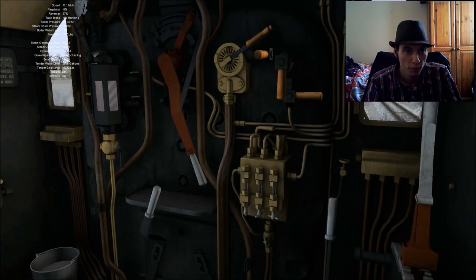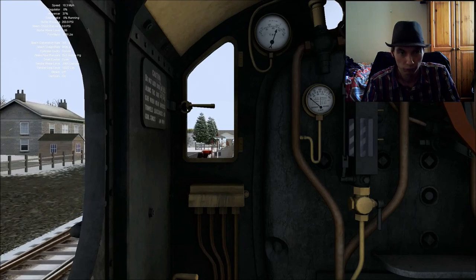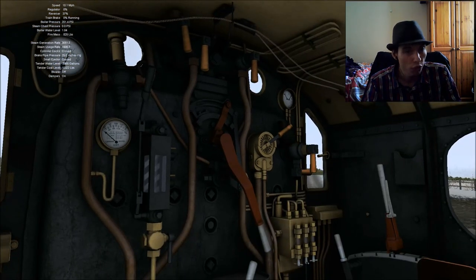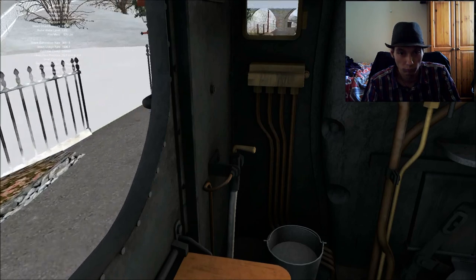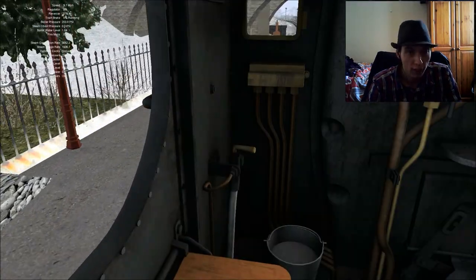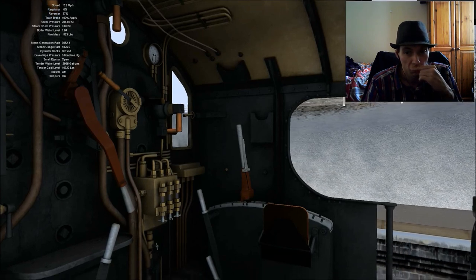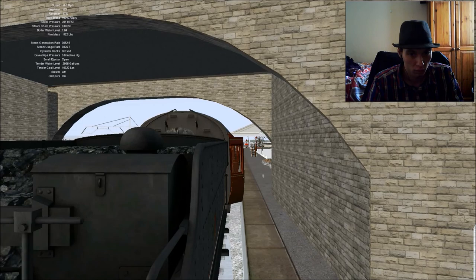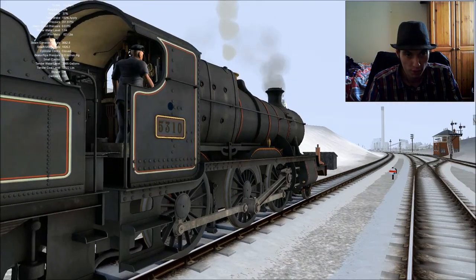Open the ejector just to take the brakes off, because we're in danger of underrunning the platform. Go to this side, so we'll be able to see a little bit better. Right, our brakes have completely released, so we close the ejector. Saves wasting steam. Okay, and the brakes on again. Just double check the injector water is closed. It has.